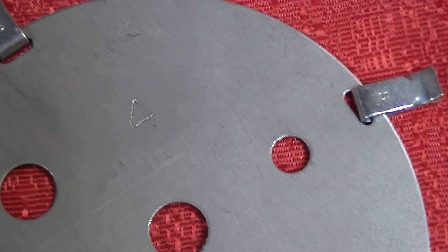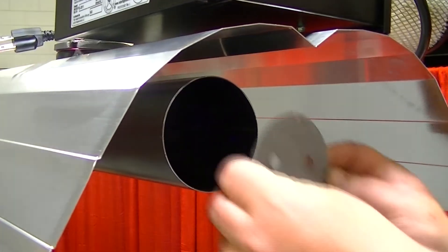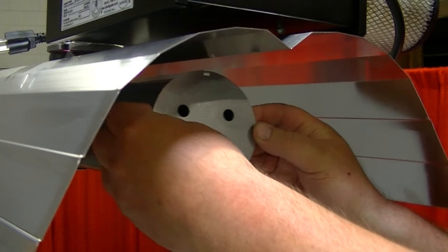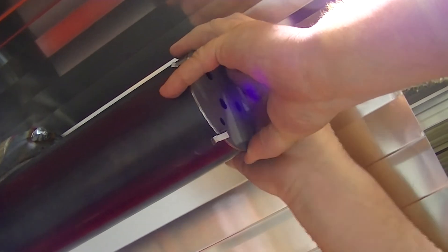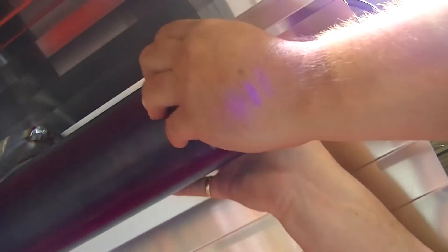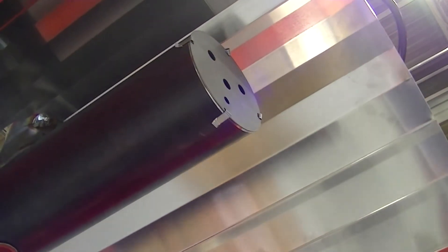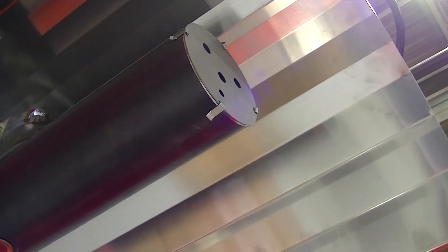For example, if the burner is 40,000 BTU, the number stamped on the end vent will be the number 4. Using the end vent plate clips, place the U-clips through the end vent cutouts. Place the end vent plate against the combustion chamber and push the U-clips onto the combustion chamber. Make sure that the end vent plate rating is located on the bottom and facing the installer.